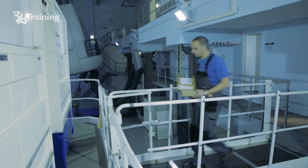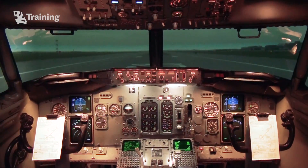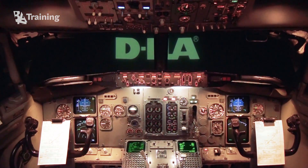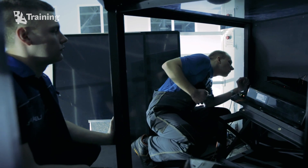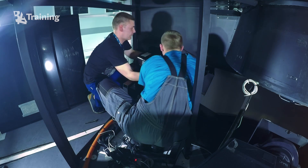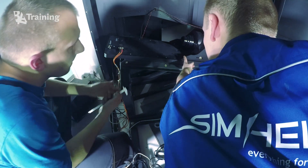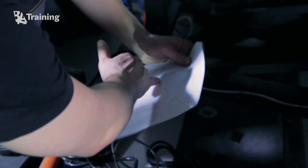When preparation is completed, the process of a projector update can be started. Stop the visual generator, shut down all visual system computers, projectors, and isolate the visual system circuit assembly. Remove all covers to access the projectors area, disconnect all the cables — start with the power supply cable. Remove an old projector from its holder and mounts. If a projector's lens is connected with an external lens, loosen the connecting screws first and only then start removing the projector's fixing screws.